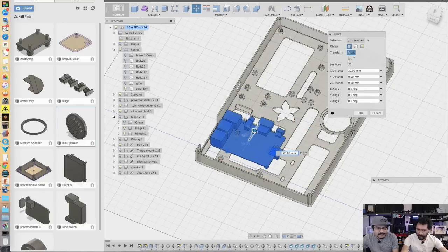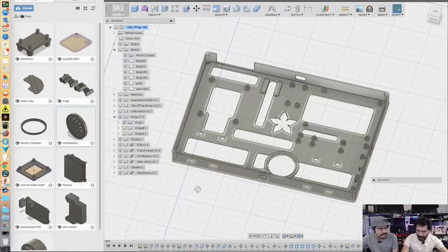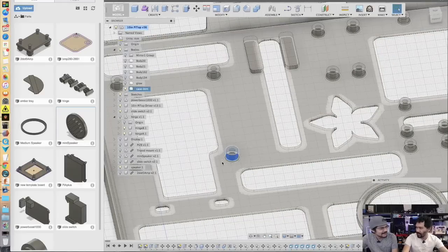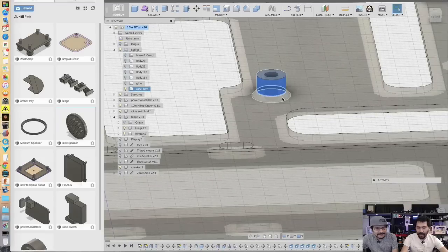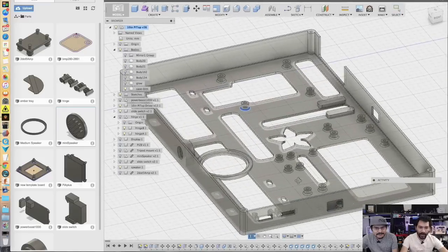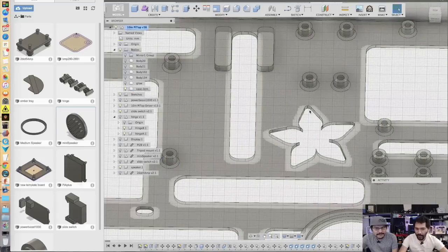You can use either 123D, which is free, or you can use Fusion 360, which is also free for students and businesses earning less than $100,000. Right. So once you drop that in, the standoffs are included in there. All you want to do is move those around and then merge it into the final case. And as you can see there where I have highlighted, you definitely want to add a chamfer to the bottom of the standoffs so you can add strength to it.